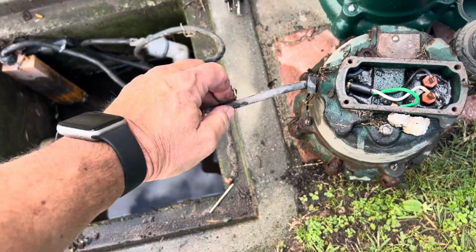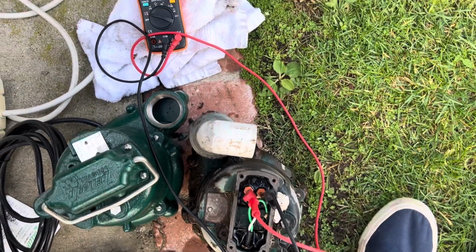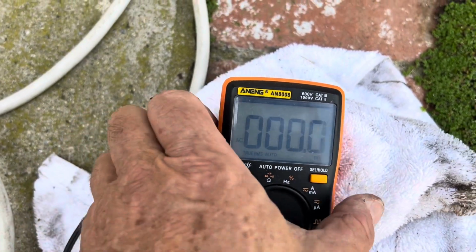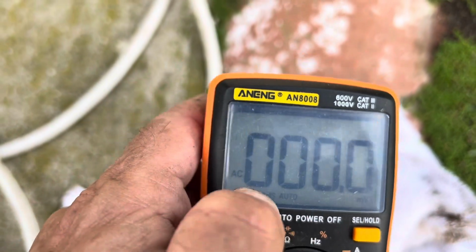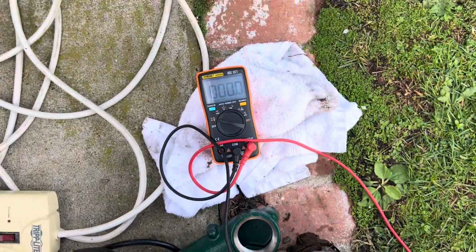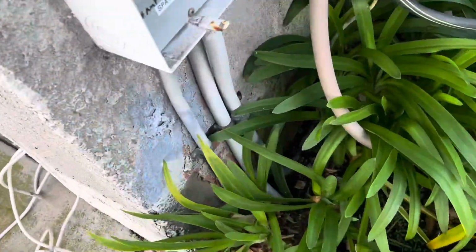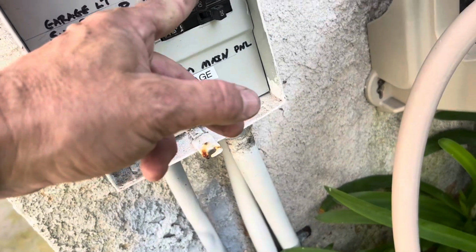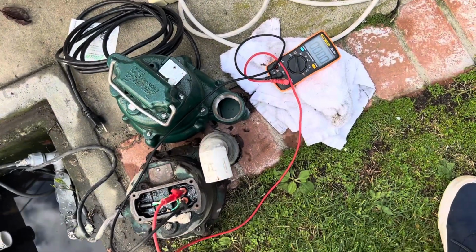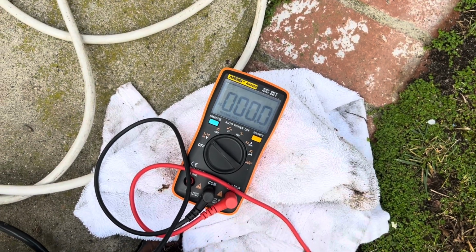What I think I'm going to do is use some marine shrink and a voltmeter on the AC scale. You should see AC. Have your voltmeter set to AC right there, see? And you should be getting 0 volts. But just in case you screwed up and didn't set your meter right, go ahead and turn on the sump pump breaker. Turn it on again. And wow, check that out. I'm not reading voltage.